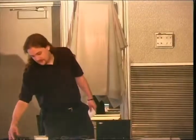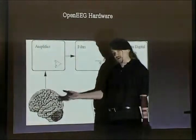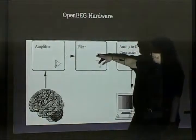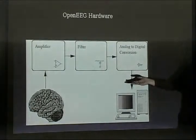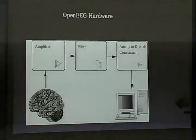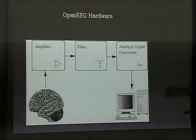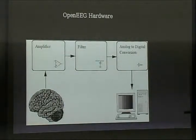There's also the open EEG, which is yet another nondescript metal box. This one has two channels, but it's expandable to six channels and does essentially the same thing. It amplifies a voltage difference between two sensors applied to the head, to pick up the electrical change caused by groups of neurons firing in the brain. It's designed to filter off everything above about 50 Hz, because while there is brainwave activity above that level, there's also a lot of interference from power lines — 60 Hz in the US, 50 Hz everywhere else. It includes an analog to digital conversion stage so it can throw the data over a serial port to a listening computer. There is a software environment around this for monitoring brainwaves and sorting them out according to frequency, though there's not a lot of software for driving effectors like the blinking light goggles, and that's what I'm aiming to fix.